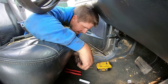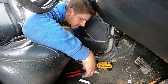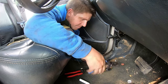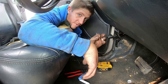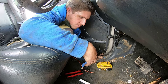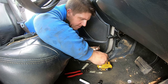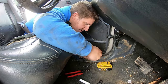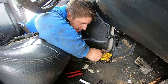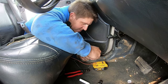You're also going to need some kind of battery for your cordless drill or impact or whatever you have. Then we need to get a little bit of wire stripped off here. There's a main power feed which is almost always the orange wire on GMs, and a main ground which is almost always the largest black wire in that connector. Take those and get them connected to your battery — which terminal to hook it to will vary depending on which type of battery you're using.